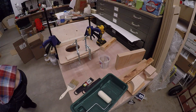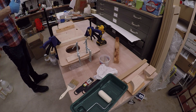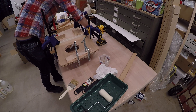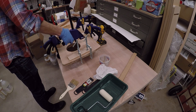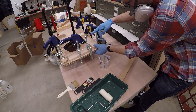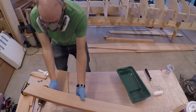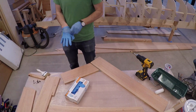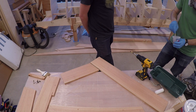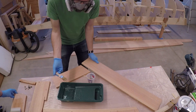These are the two halves of the centerboard and I decided to laminate them together first as sort of a test to see how it would be to laminate the transom together. These are the Doug Fir lamination layers for the stem. Unfortunately, a lot of this footage is poorly positioned off-camera, but it's a three-layer lamination similar to the transom knee in the way it goes together.